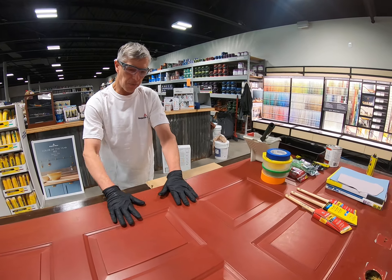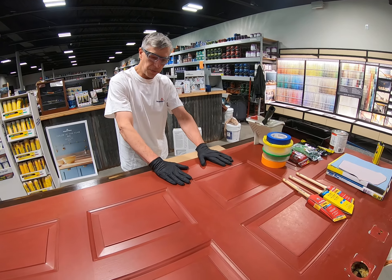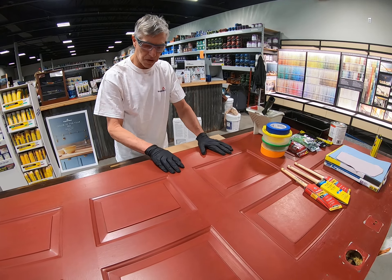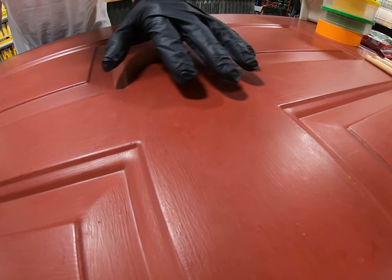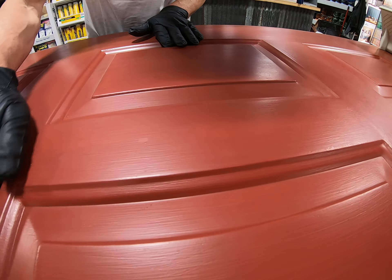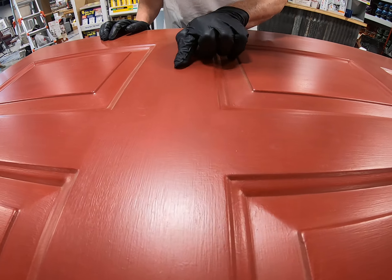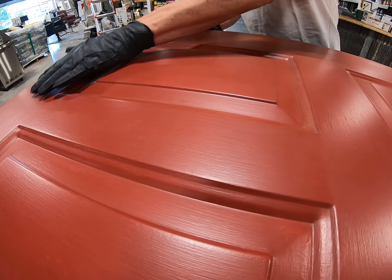The first thing starts with just the product choice. If we have a paint that is hard to brush or apply, we're going to end up with these brush marks. And if the paint is drying quickly during application, you'll see when the paint was brushed in this section, then they came back and brushed this section. Once this paint starts stiffening, we get all the typical brush marks.